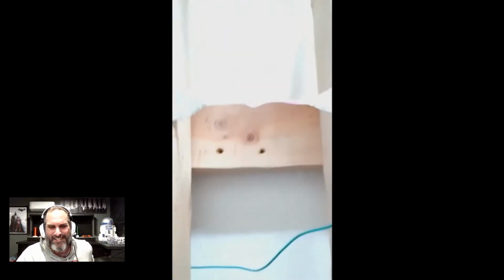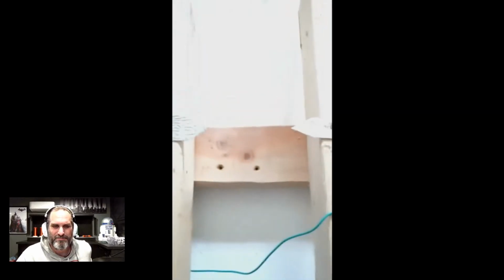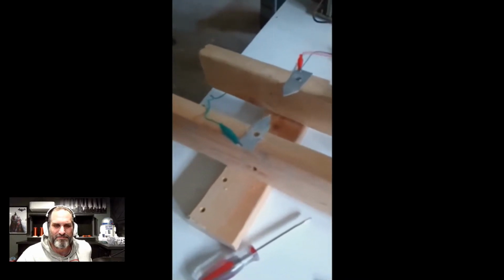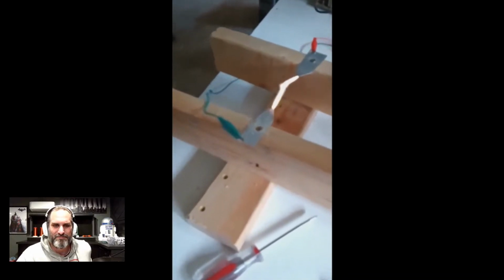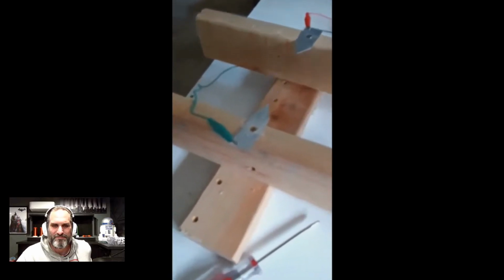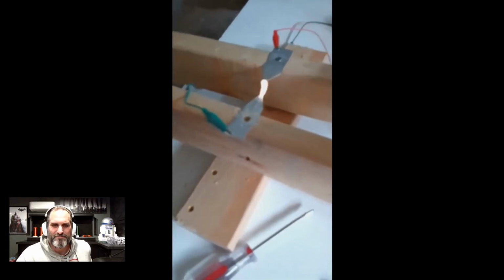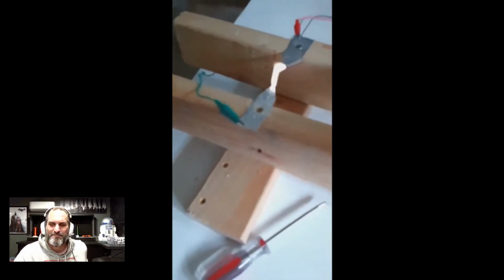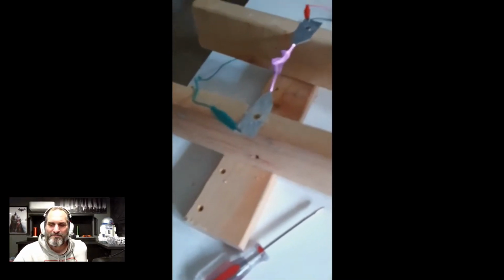Just keep going. Keep frying it. The spark gap on this gets pretty big, but you have to start it real small. As you can see, we're about 1 inch away when we start. We get up to about 3 3/4 inches on this thing. Pretty decent spark, pretty good on amps. It's not as light as two flybacks together, so it's got a real thicker approach to it in the beginning, and it thins out as you pull it apart.